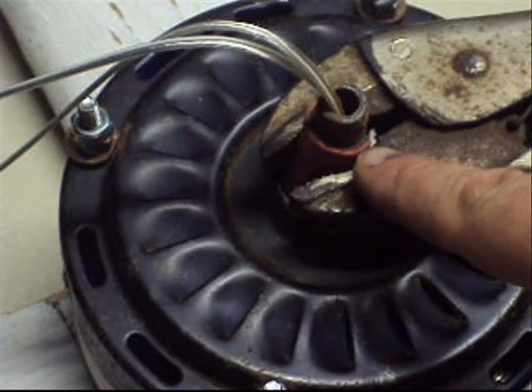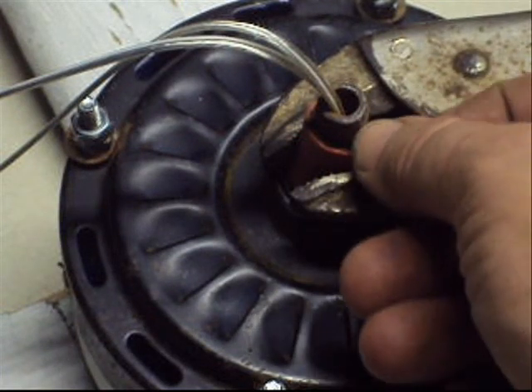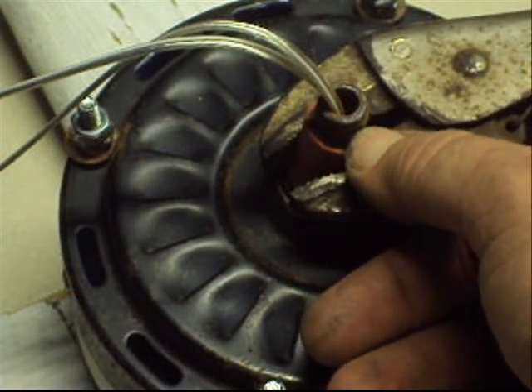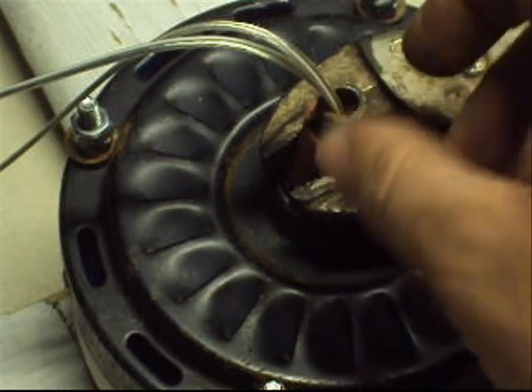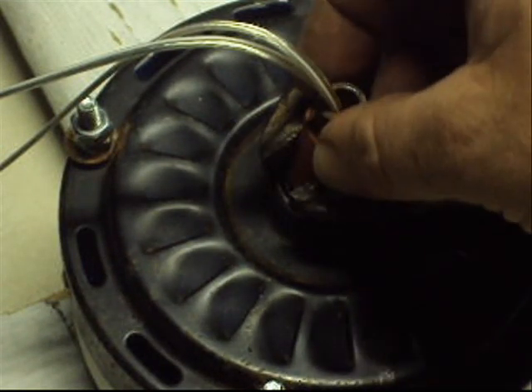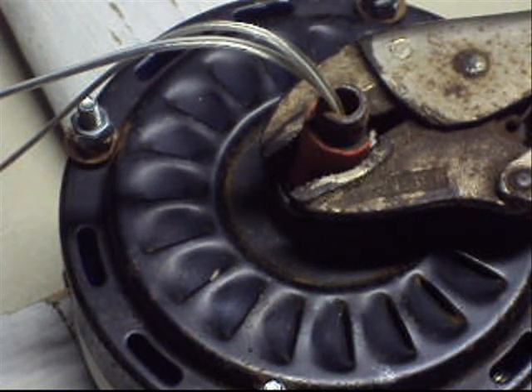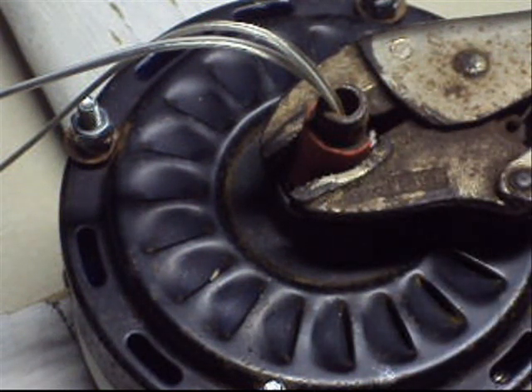If you look right here to the middle, you'll find I've got a piece of rubber hose that I slit down the side rather than smash it down. This is so when the vice grips went on here, I'm not messing up any threads. Although this is going to have to be re-threaded here — two threads were stuck in before and then I had it welded, but the threads had slipped and they were pretty weak. One wild night of wind and it fell down on the roof and broke off. Where I had the tack weld, it even broke that, but showed no signs of twisting like for turning — so I know it just broke right off. About two and a half to three threads show a little bit different weathering, and that's how I know how many threads were inside and it wasn't enough. So I'm going to put a tap down the middle of the other piece on the framework and put a die on this and get these threads to match up. Then they'll go in and I'm going to take it in at least five full turns — I want five threads at least. Anyway, I'm Scott Brown with Green Wind and other home energies.